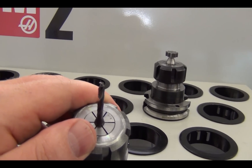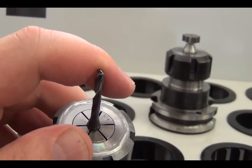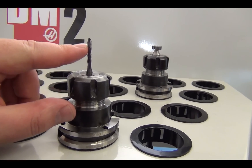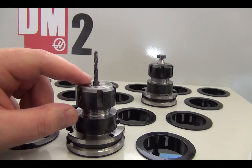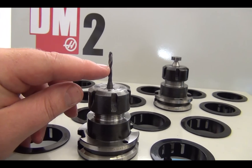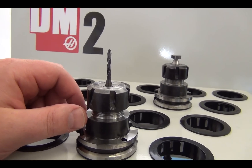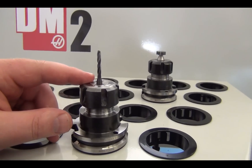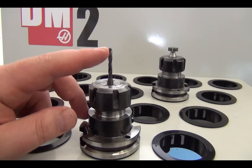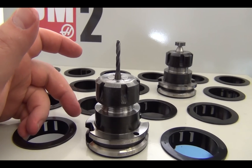There are two tiny holes at the tip of this drill. Why is this so important when drilling? When you're drilling, you're burying your cutting tool into the metal — typically multiple times the diameter of the drill. Chips get caught in the flutes, they can't evacuate quickly enough, and you end up snapping off the drill in the part — ruins the part, ruins the drill. Carbide drills are very expensive, and this one was around $90, the most expensive drill bit I've ever purchased. But it's so fast because coolant is constantly on the cutting surface, pushing chips up and out through the flutes.